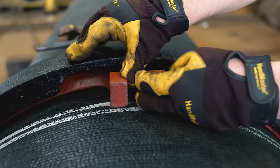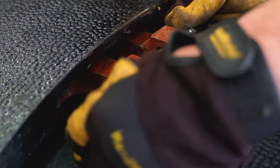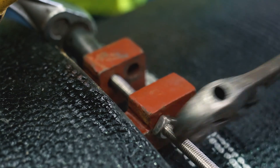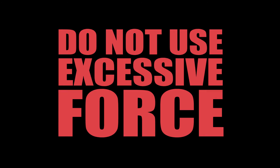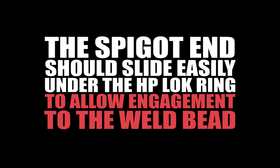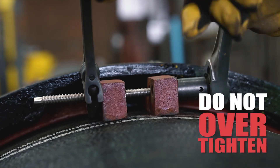Slide the ring handles to center them in the bell slot. Insert the bolt through the second set of through holes in the ring handles and install the nut. Snug the nut with only enough torque to make sure the ring stays in contact with the pipe. Pull back on the inserted pipe to extend the joint and remove the slack — do not use excessive force. The spigot end should slide easily under the HP lock ring to allow engagement to the weld bead. Tighten the bolt nut to 15 to 20 foot-pounds of torque.